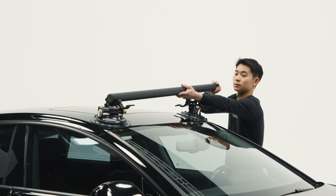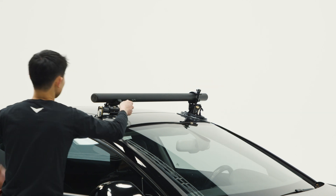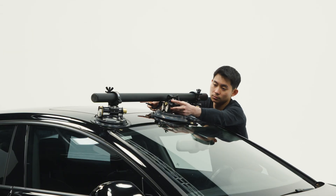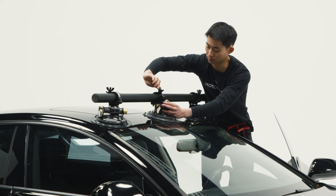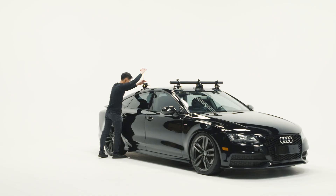You can now place a length of steel speed rail between the clamps and close the clamps around the speed rail. If additional suction cups are able to be added, position a third or even fourth suction cup underneath the speed rail and actuate the vacuum pump to ensure proper seal around the perimeter. Fasten the speed rail clamp and then the handle clamp last.